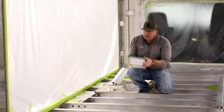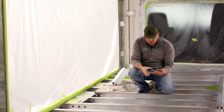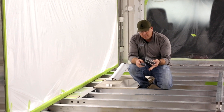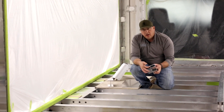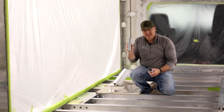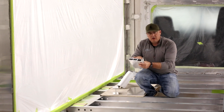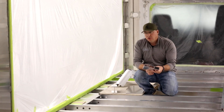On top of the I-beam construction, we move to our walls. The walls sit directly on the I-beam. Our typical wall construction basically uses two different extrusions — structural tubing, all minimum of eighth inch wall, one-twenty-five wall. This is an inch and a half by two and a half, and this is an inch and a half by five, three-sixteenths wall, and this is what's called a double hollow. It's got an additional section in the middle that gives it tremendous strength — as much side to side as it is this way, and that additional tubing gives us a lot of rigidity. When you've got 20 to 22-foot slide-outs pushing with 5,000 PSI of force pushing against this, it's not something you want to go light on. You will tear your unit up going down the road.